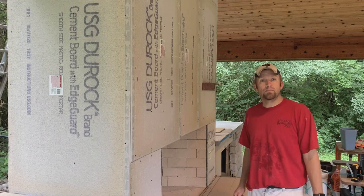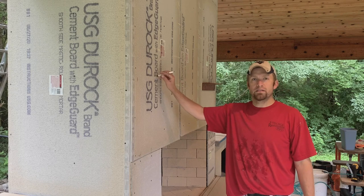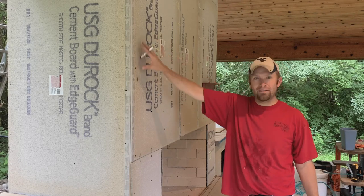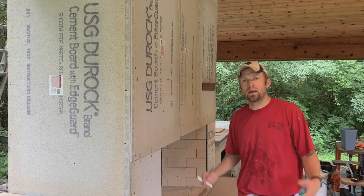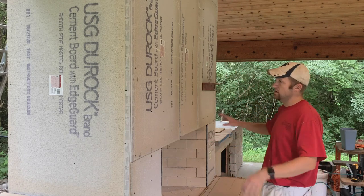Morning everybody, we're getting ready to put the mantel up. So if you remember from an earlier video, we put a bunch of backer board behind here. There's two 2x6s, so essentially everything right here is solid wood and anchored into this structure. So we have two pieces of angle iron. One will sit on each end.